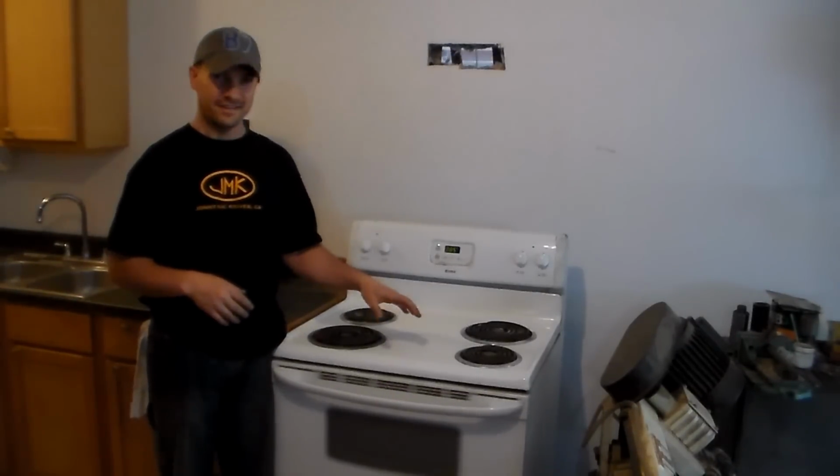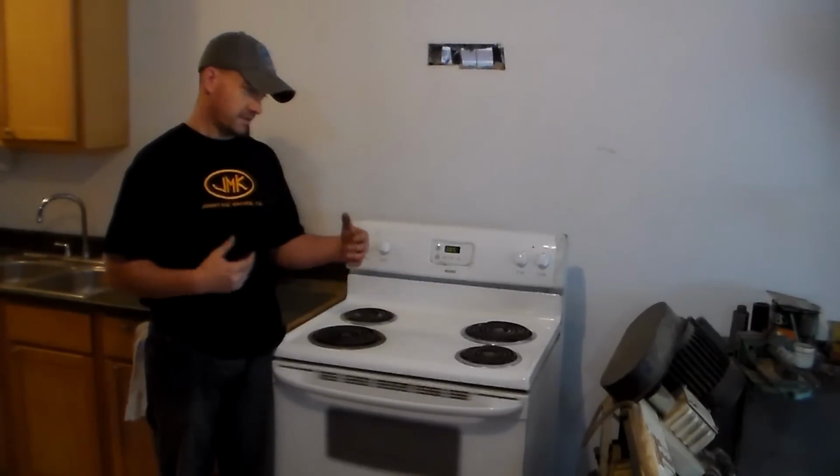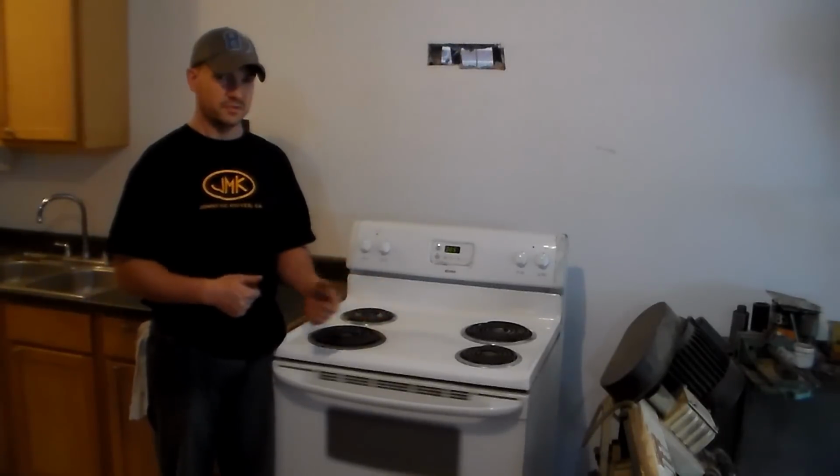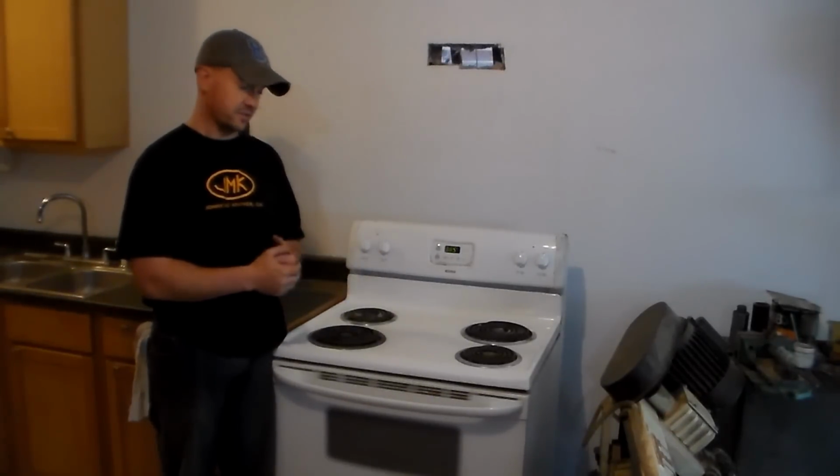And I sort of inherited this with the shop, just a regular household kitchen oven, but I've checked it with 3 different thermocouples, temperature probes, and it holds temperature really accurately in this range. And so this is what I use for all the tempering on simple steels like these.